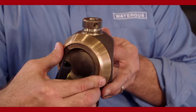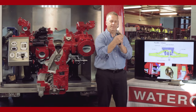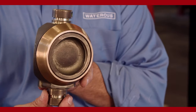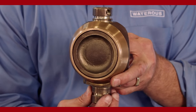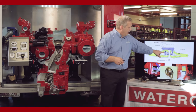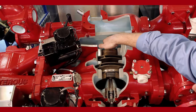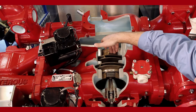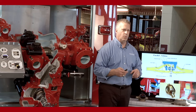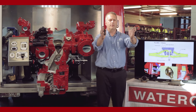We have a wave spring and an o-ring behind it, so as it transfers between volume and pressure, if it gets sand or debris in there, the seal just pushes back against the ball, overcomes it, and switches into the proper position. In testing, they pumped a pound and a half of sand per gallon of water through this valve and it did not jam up. In volume position, we take 500 GPM at 100 psi from each impeller and push both into the discharge manifold — water comes in together, splits apart, and comes back together for 1000 gallons a minute at 100 psi.